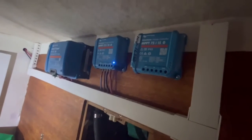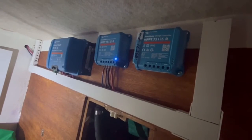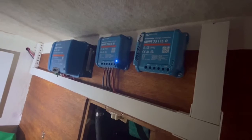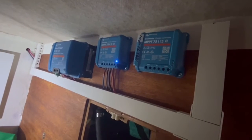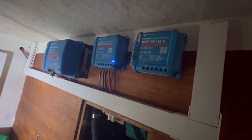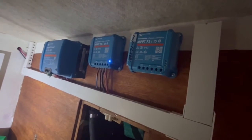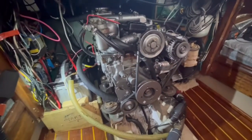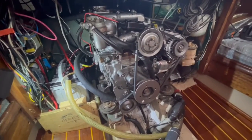There's the finished wireway with all the wires connected and hidden away. I've got a spare MPPT charger here — probably going to put a separate panel on it. If you common up panels on the same controller and one panel is shaded they both die down, so every single panel on this boat is going to have its own charger.